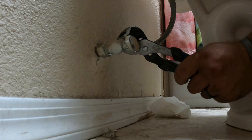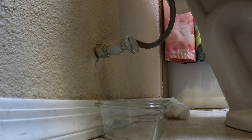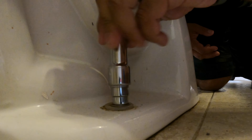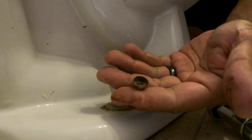Knowing that, the sooner the better we get to it. First, we remove this old and archaic plumbing line. You have to turn off your water first prior to that — just remember that, or you're going to have all kinds of problems. Then after that, it's as easy as removing the hardware. Looking at this one after we get it off, it doesn't look too promising — the screw is completely rusted out with a lot of the threads missing.